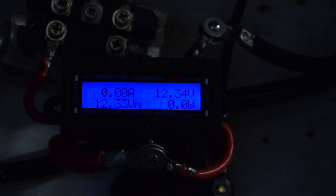Reading off the logged data: it's been generating power for a total of 36 minutes and 50 seconds, in which time it generated 22.4 watt-hours and 1.7 amp-hours. This meter is really nice — it gives you amp-hours, watt-hours, and the elapsed time for how long it's generated power. So over 20-some hours, it only generated power for 37 minutes because the wind has been very, very light.